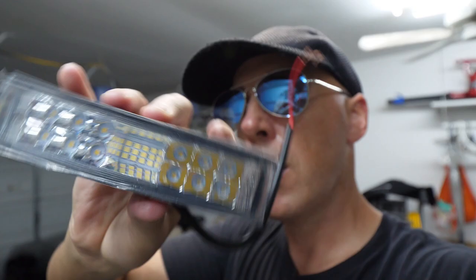Here are the LED lights I'm going to put on — I have two seven-inch light bars. I'm going to have one on the front and one on the rear. I've got this 12-volt battery from a kid's Power Wheels — it's rechargeable. I'm going to mount this in a plastic box on the back of the wagon and wire up a little circuit for it, running it off a toggle switch.